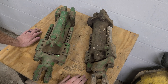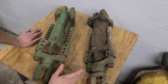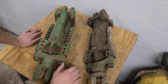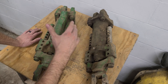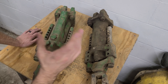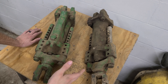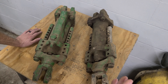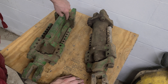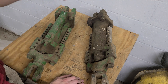Let's start with an important safety note: if you ever have one of these sitting around, never hook it up to any tractor other than a two-cylinder tractor. The operating pressure of two-cylinder systems is much lower — I want to say something like 600 PSI — very low compared to today's hydraulics. If you hook it up to a newer tractor, basically anything new generation and above, you can see there's a huge crack here on this cylinder — it will just bust the main housing.